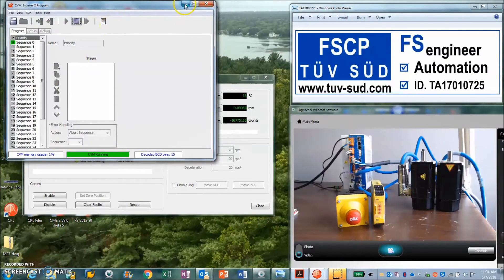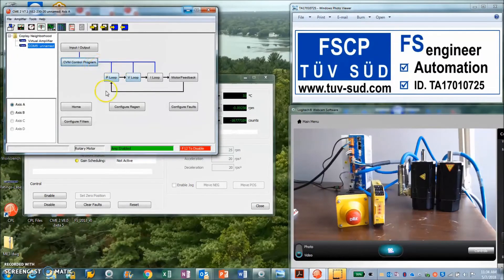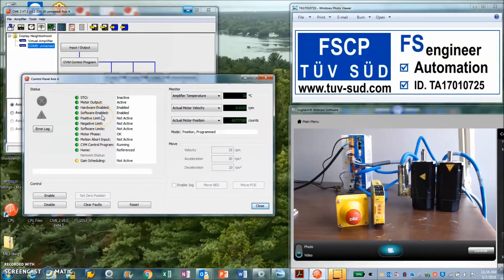Let's run our back-and-forth motion. We need to configure the system to come to a controlled stop before the STO gets activated. The relay has an instantaneous contact connected to the drive signal input, and then a delayed contact — 200 milliseconds later, perhaps — which goes to the STO to disable the H-bridge permanently. So: come to a controlled stop first, then disable the output stage.